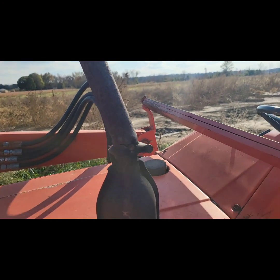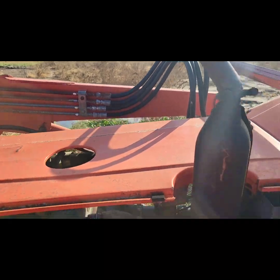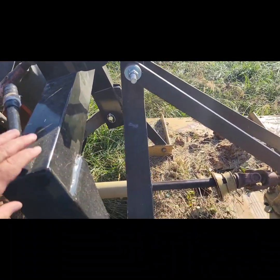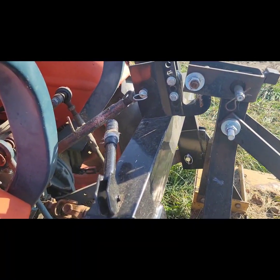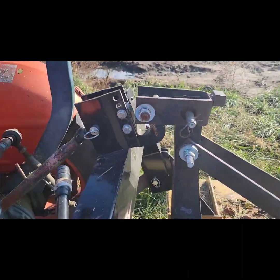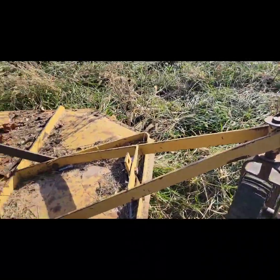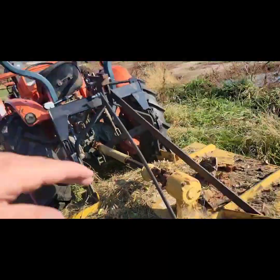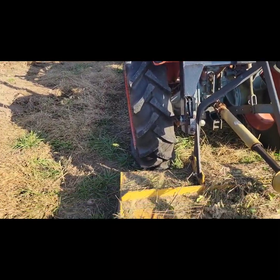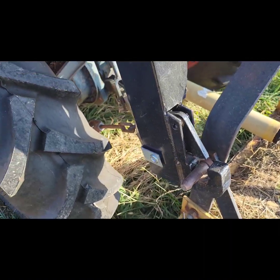Stick it back up here, keep some of the water out of it in case it rains. We're still fine-tuning this quick connect here — I think I figured it out but I'm not sure. It didn't drop off or try to jump off. I think I need to drop this wheel back here back down so that it keeps it tilted towards the front, and that'll keep that down in that hook where it belongs. And I need to get some bushings for these pins right here so that they fit in there a little snugger.